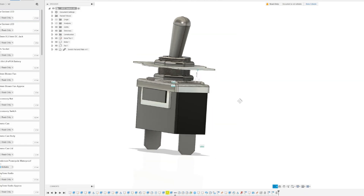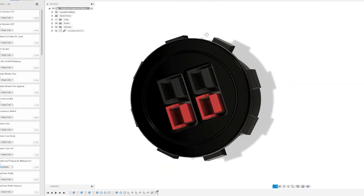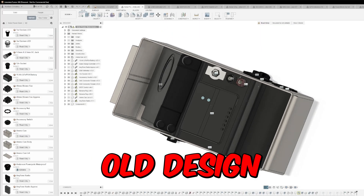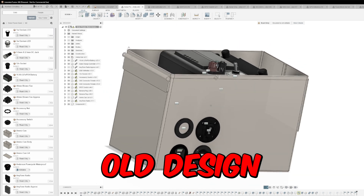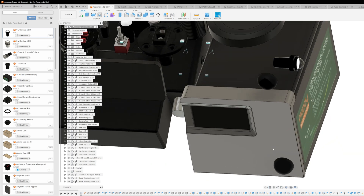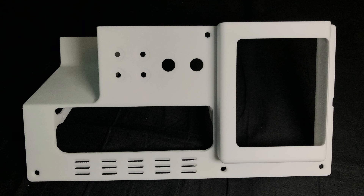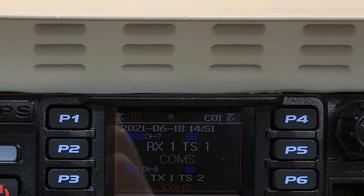So to design this, I modeled every single component in Fusion 360. This took a really long time, but if I was going to squeeze in as much stuff as possible, I had to be sure everything would fit and be in a functional position — meaning I can't just put components in random places just because it fits. It took a couple of iterations, but I got everything fitting exactly how I wanted. I also designed a few 3D printed components that hold things in place and printed them myself, but the main panel was too big to print on my printer, so I had it printed by Shapeways in nylon. I should have done some fit checks before ordering, but I'm impatient — nothing a Dremel can't fix.